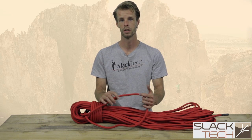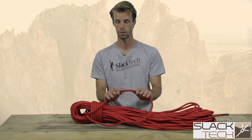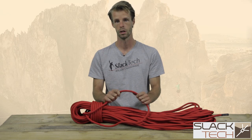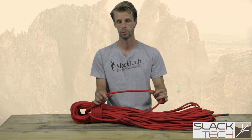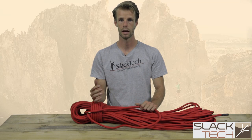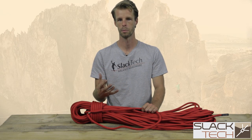You don't want to put an oversized rope into a small pulley. You also really want to pay attention to the stretch. Static ropes and low stretch ropes work a lot better than dynamic or climbing ropes, because it allows you to transfer most of the energy into the system as opposed to it getting absorbed by the rope.